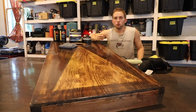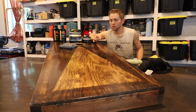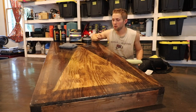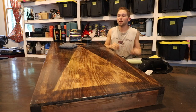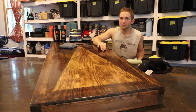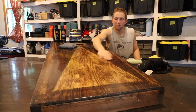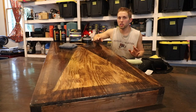After you finish staining, you need to apply the polyurethane. I use acrylic polyurethane — you can use an oil-based polyurethane, but with acrylic polyurethane it won't bleed any of the lines. If you use an oil-based polyurethane, some of the lines may bleed and it may turn a little bit yellow. When you apply the polyurethane, however many coats you do, before you do your last coat you want to go over the board with 500 or 600 grit sandpaper, knocking out impurities in your previous coats, then apply your top coat.